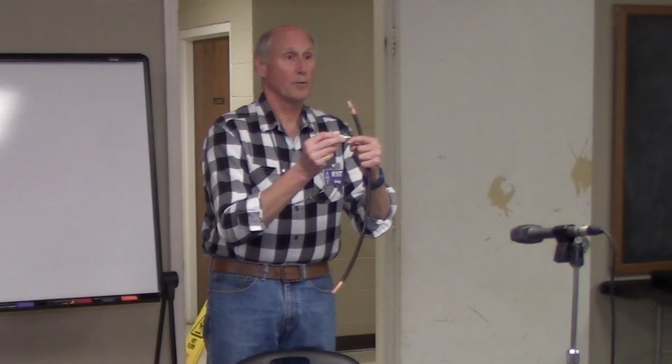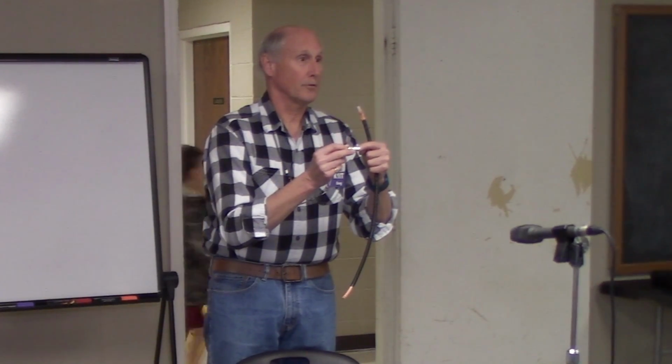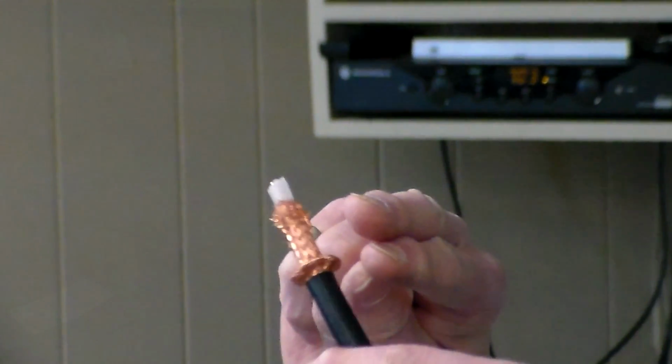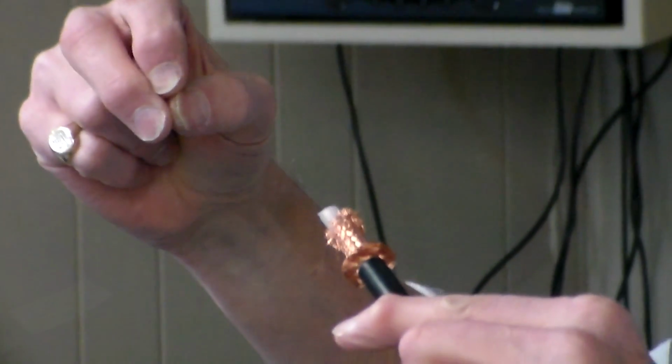So the second step in this is, because of the difference in the way I'm going to solder this connector to what we all learned, I'm going to solder the braid around the outside of the connector. I'm not going to put the braid inside and try to solder through those little holes. So what I do is just push the braid back a bit to form like a little mushroom here, maybe about a quarter of an inch or so. I take my scissors and clip around that and pull the excess braid off. So then what I'm left with